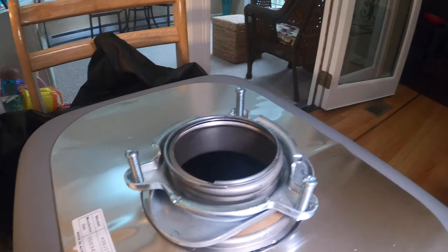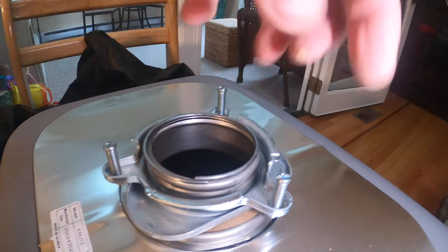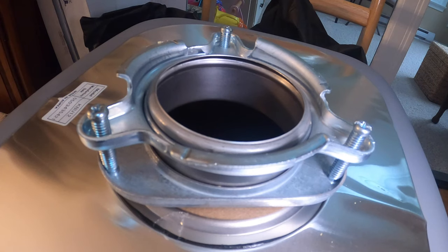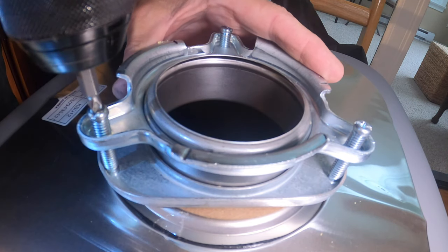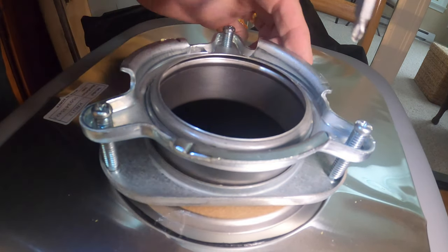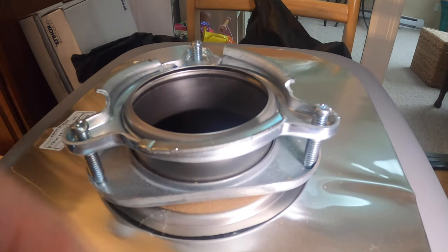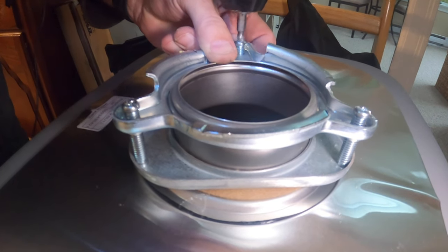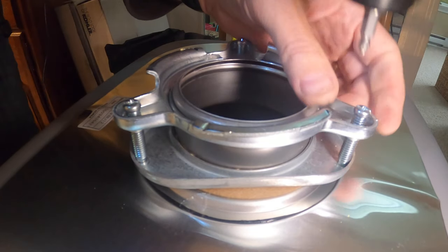Under the sink it's a little bit harder, but this way it's pretty simple. Just open that ring up with two hands, pop it right onto that ring, and that sets it in place and keeps it nice and tight. Then take a drill or a screwdriver and pull that bottom piece towards you — you're basically compressing the plumber's putty, which makes a perfect seal. This is really simple, and then the garbage disposal pretty much attaches right to that bottom ring. That's pretty much how that works.